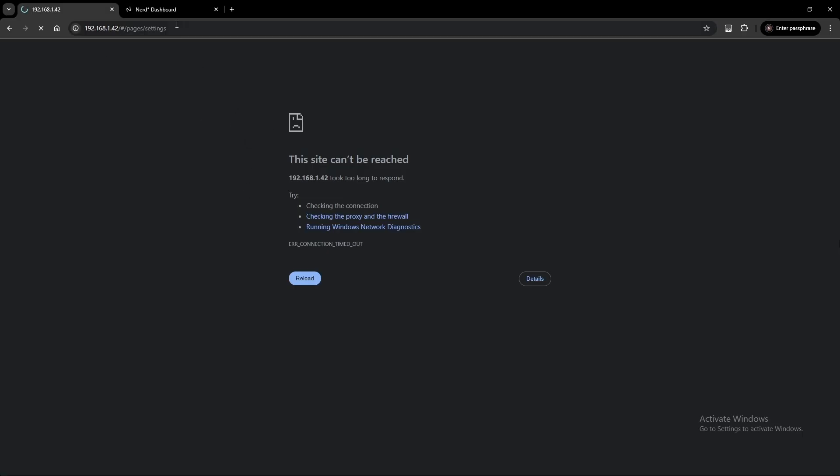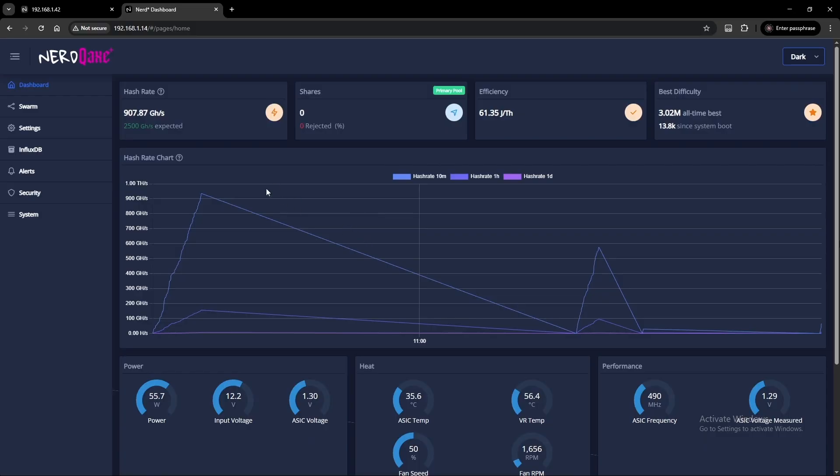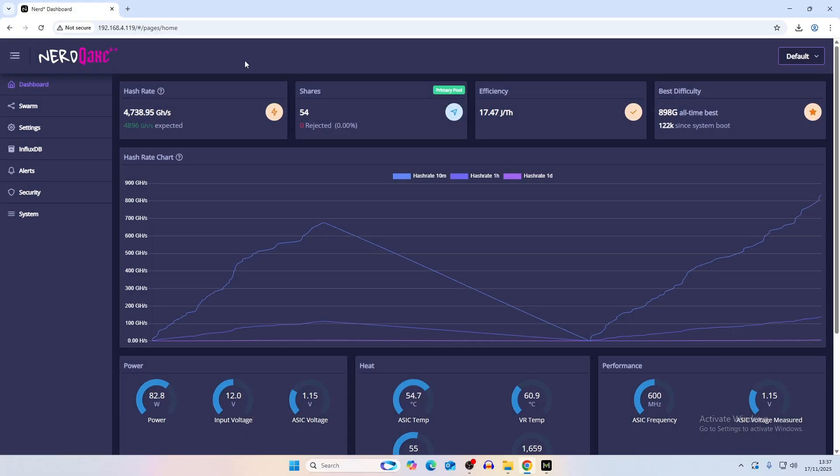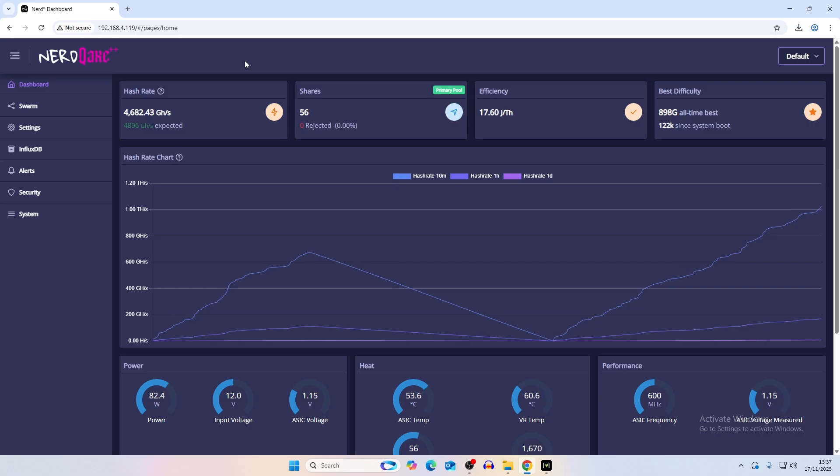That's what it should look like. You can click back to Wi-Fi if you want. Make sure the cable shows a red light on your LAN module, and a green and orange light on your ethernet cable. If you're struggling, some quick fixes are: reset your router, change out the ethernet cable if it's not getting a connection, and give the bitaxe or nerd qaxe wires a little wiggle just in case anything isn't properly fitted.